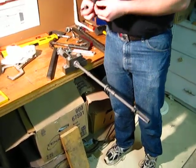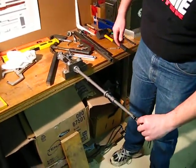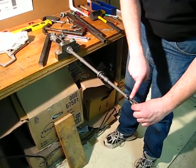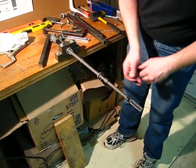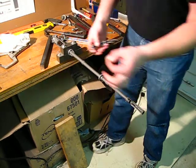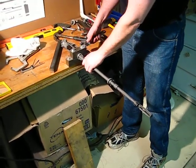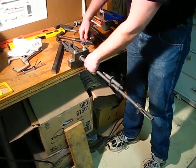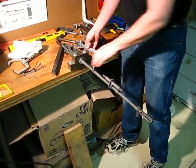We've done dozens of these with very few problems. First thing, a 1/16th Allen. There's a set screw right here — it goes into the castle nut to keep it from rotating. We need to back that out. So we back out the set screw and basically set it aside. Now we're going to lock this into the barrel vise, point it upwards. The gun at this point needs to be stripped down so that it'll go into the barrel vise.